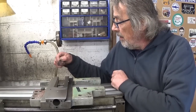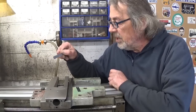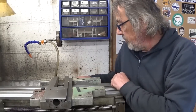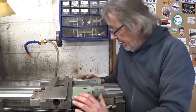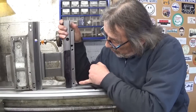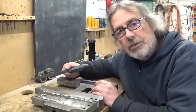This one is 0.06 millimeter — 0.0025 inches, as it's marked here, otherwise I wouldn't know — so a very very thin thing. And this one I can go about to before the middle before it starts to bind. So my filing work is getting better. What I do: I make it black with my Sharpie, then I slide a little bit and then I can see where it touches.